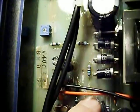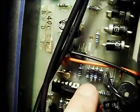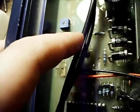One thing to note is that they're all 1% tolerance resistors in this, which means that most likely these aren't truly 1%, because in China, 1% tolerance resistors that are off-spec are available for insanely cheap, like a tenth of a cent per device or less. So most likely they use these because most electronics like this only need 5% tolerance resistors, so they just use these and shave a huge amount off their device costs.